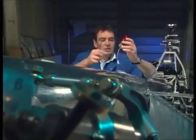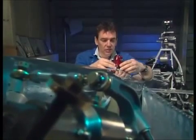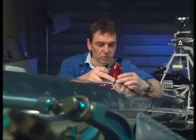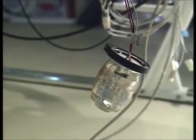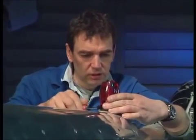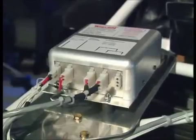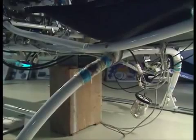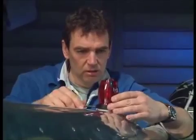Anti-collision lights first. The one at the back is red — it just pops in here. There are two anti-collision lights. You don't have to have anti-collision lights, but I think it's completely stupid to go flying any aircraft and not have as much visibility as possible. There's a white anti-collision light that will just dangle on the front for testing purposes, because we can't actually fix them all until the body's on. There's a control unit for the anti-collision lights, which you can set for different flash patterns. The one I've set up is three flashes at the back and then three flashes at the front, which is called a comet flash. So that's on there.